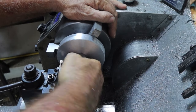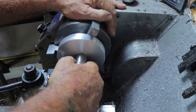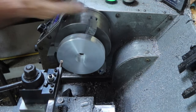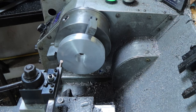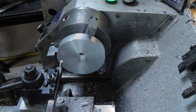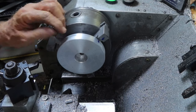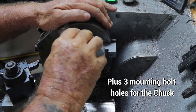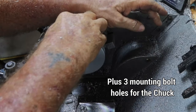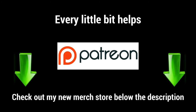Just a little bit tight. Down this end is where it cuts a bit of taper but I'm going to leave it at that — it will only end up too loose if I start messing around with it. Theoretically all I've got left to do is clean up the outside — just a tiny mark here where the two machining passes meet.